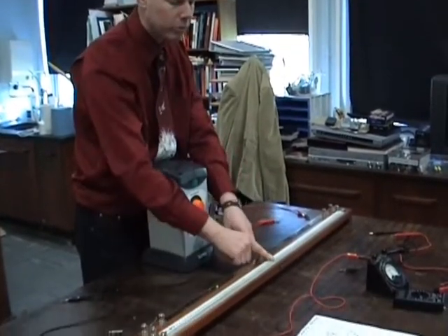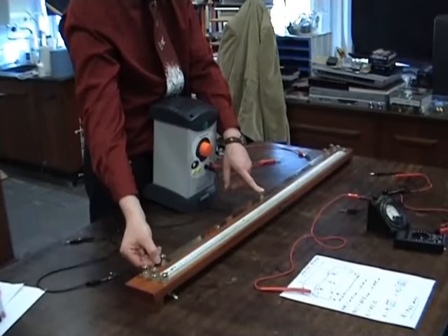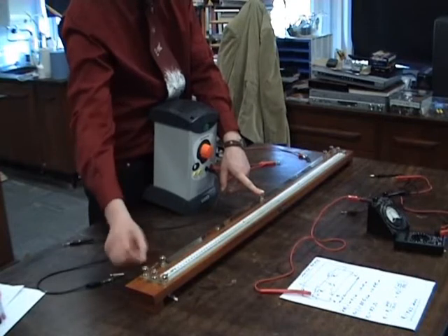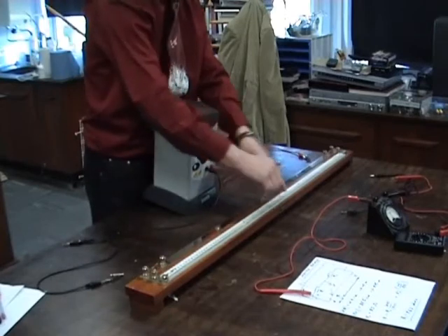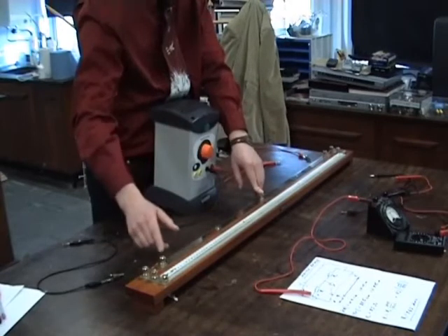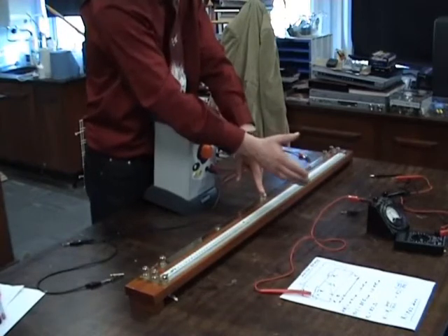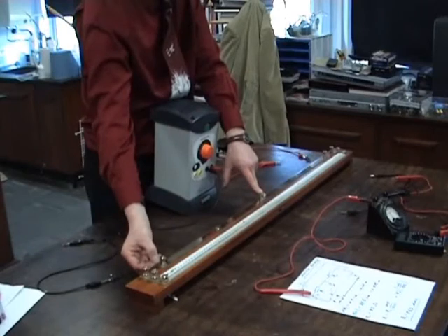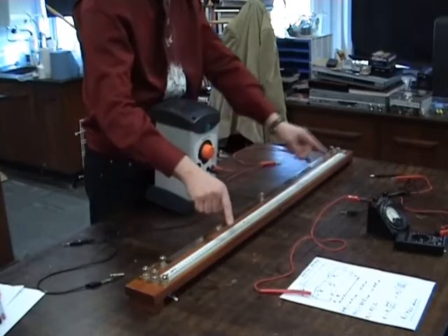Now you've got resistors here. If the temperature goes above 22 degrees, what will happen to this resistance? It's a normal resistor — what happens to the resistance of a normal resistor? It increases. If the heat goes up, the temperature goes up, the resistance will therefore increase, therefore you'll get current going through this part of it. Remember it was balanced — what will happen is current will go in one direction. If it happens to go one way, I need to turn on my cooler, or turn off the heat. It then cools down and goes below 18 degrees. So now the resistance here is going to go down, and therefore the current is going to go the other direction to what it went before.